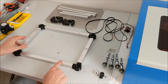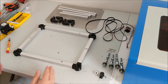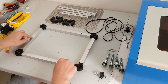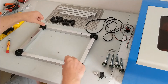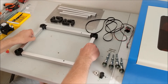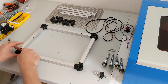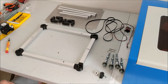I've already made some holes here for mounting it on the bottom plate of the laser cutter. I've made three holes - with four you get the possibility of twisting and you have to be really careful about not twisting the entire frame out of alignment. With three, if I wanted to level it, I can do that. And these holes are more to the side because the belt will run just off the center of these tubes, so I decided to put them more to the side.